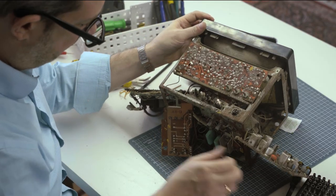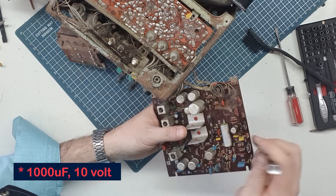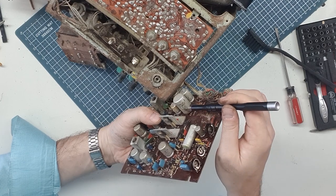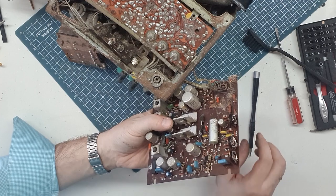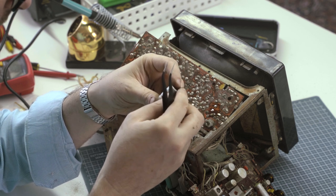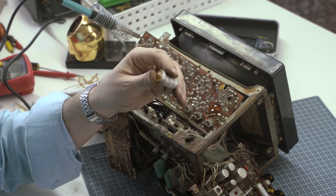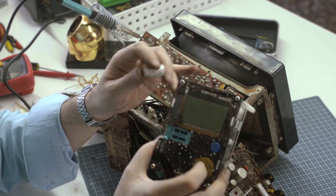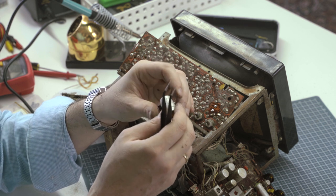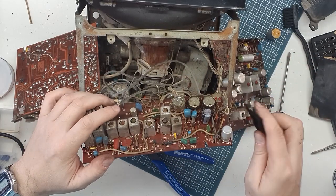I don't see any caps that clearly need attention. Maybe we should pull one of these 10-microfarad caps off and see where things stand. Date code June 1990. I pulled out this cap rated at 1000 microfarads at 16 volts. It measured 950-955 microfarads, but 3.5 ohms ESR. Not terrible, I guess, but I couldn't bring myself to put it back in there, so I put in a new cap.